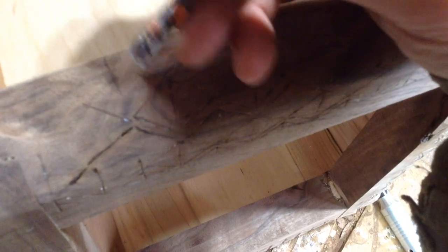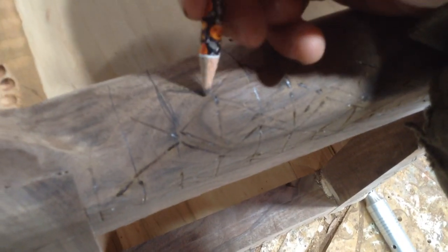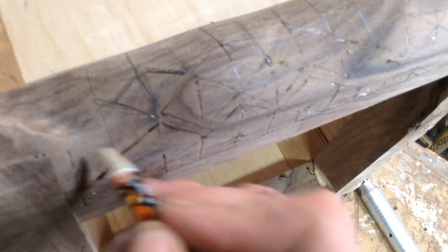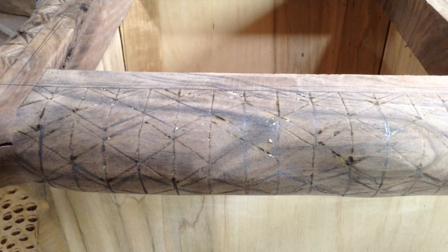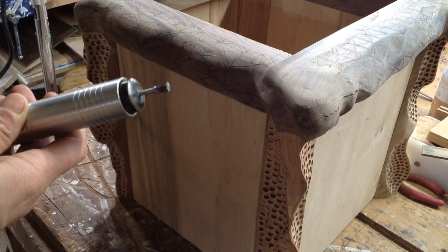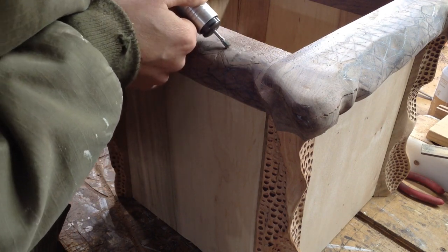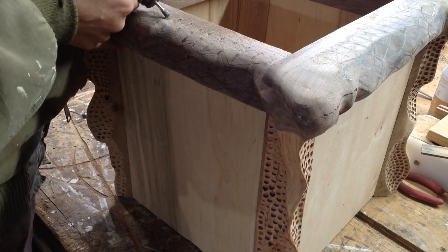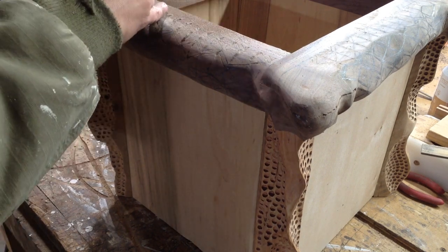For the carving on this I'm using an abrasive dovetail bit in my rotary tool — I did most of the carving on this with that. The dovetail bit leaves a nice chamfered shape to the piece. I'm going through and following my lines. This is a pretty simple, very low relief carving with not a lot of detail, and it's symmetrical so I'm doing all my vertical lines first.